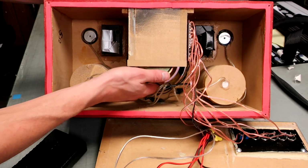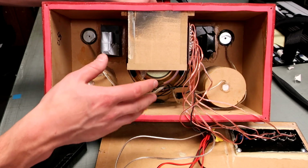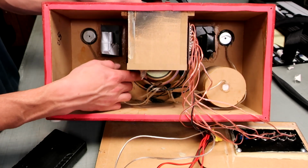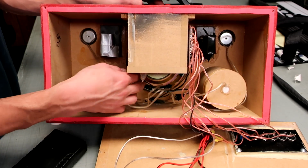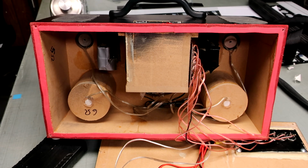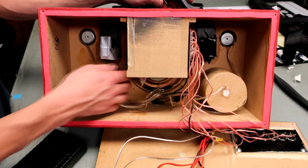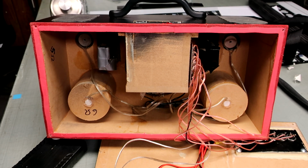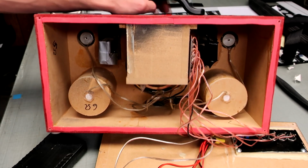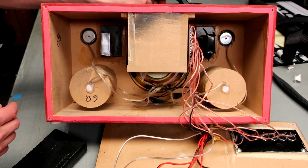The large speaker, what I did to figure out the size of air volume I needed for my box is I just took and measured the volume of the speaker that I took the driver from. So instead of doing any calculations or figuring it out myself, I just trusted the fact that someone already put some thought into designing this speaker. And that may or may not have been a good idea, because it actually was a pretty cheap speaker. So they may not have put the most thought into it. And I figured that out after I messed around with the ports.